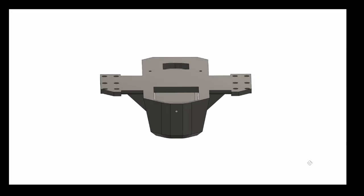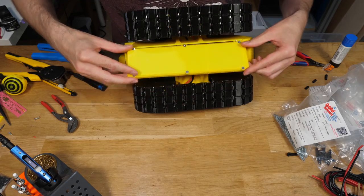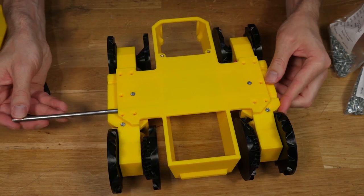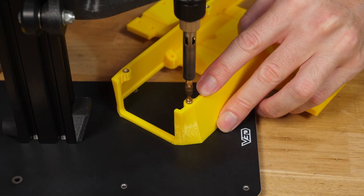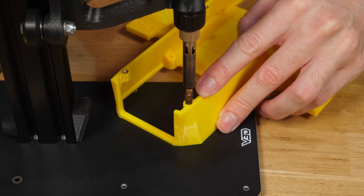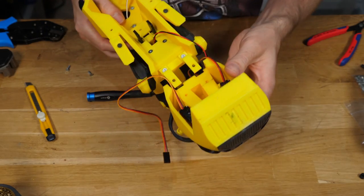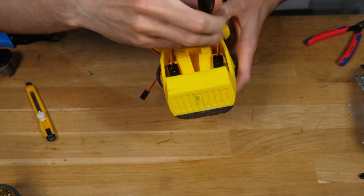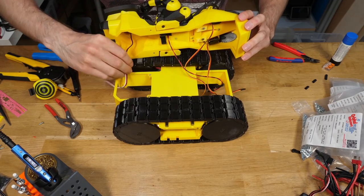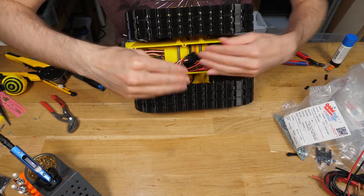The front control panel is a really cool idea where the levers move to correspond with the motor power. Assembly of this part didn't provide any major issues — just make sure to get the servo arms oriented correctly as you assemble them, because they're not very easy to adjust afterwards. For the chassis, I originally went with the standard design, but organising the wires proved quite difficult, so I opted for the modified two-part design. This incorporates two steel bars for stiffening and uses heat set inserts in the base to allow easy removal of the bottom, giving really good access for managing wires. Getting all the different assemblies connected together is fairly simple once you know the order, but organising the electronics and wiring is basically just push it in and put the lid on.